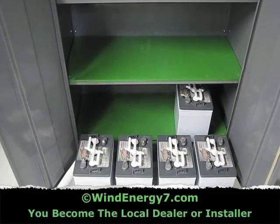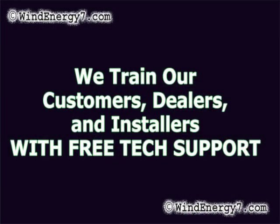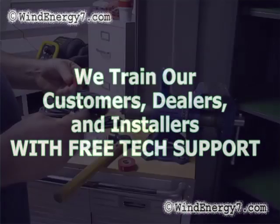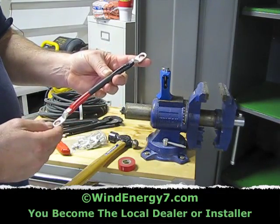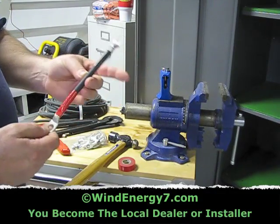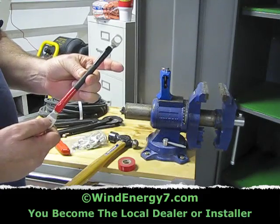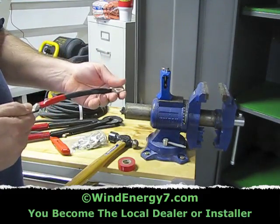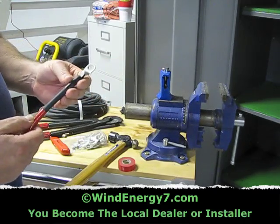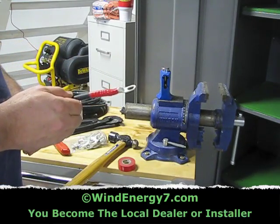Here I've got my battery cabinet reinforced in place and I'm starting to assemble the batteries and do the cabling. You've got a right-sized, perfect battery cable — highly conductive, fine stranded welding cable, very pliable. The terminal ends are squared to each other, color coded, and it fits the battery perfectly.